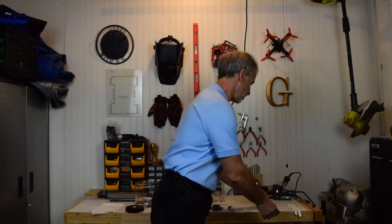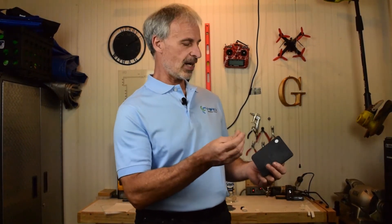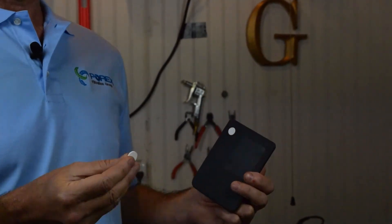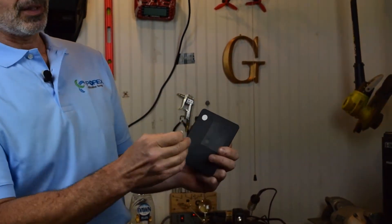The next technique is over-molding. This is a little bit more complicated and you will need dedicated molding equipment or molding tools for this. You start off with a disc of Porex Vertec PTFE — this disc tends to be slightly thicker than our membranes, about one millimeter or so. This disc is inserted into an injection mold where a pin comes down and cuts off the flow onto the vent, but actually molds around the entire vent. So you put the disc into your tool, mold around it, and you get a permanent bond to your finished product which allows it to vent.